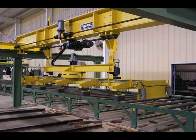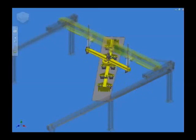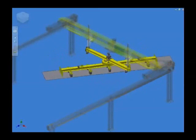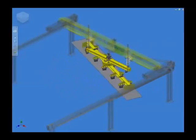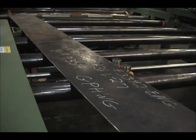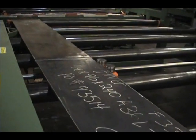The dual-row magnet gantry provides lifting and placing of the web sections onto the infeed conveyor. An optional web rotator device allows the operator to rotate the web 180 degrees while the web is being transferred to the storage area or from the plasma table outfeed conveyor. The infeed and outfeed conveyor incorporates a set of hydraulic pushers for squaring the web sections prior to weld splicing.